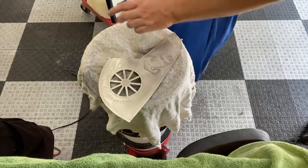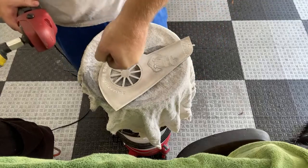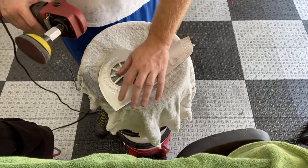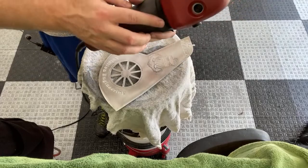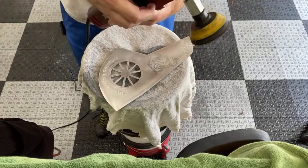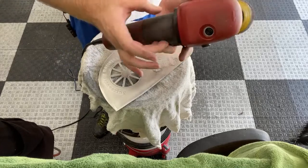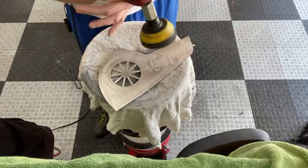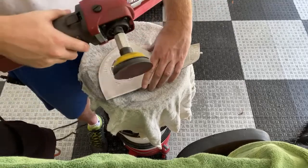This machine that I'm working with now is just a little mini rotary. I tried doing these at first with a drill, and that just wore me out. So I decided to use my little mini rotary, and it does really good. It's pretty powerful. The problem I've had with this machine is here in my garage, it gets 100 degrees. You can see it's kind of slick right there. There's an O-ring inside of here that holds grease in the gearbox, and that O-ring shrunk up or something, and it started dripping grease down through here. I had to replace that O-ring, and I still don't think that it's perfect. It was hard to find an actual flex O-ring. They're not really easy to find online. This is a German machine, of course.